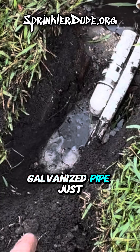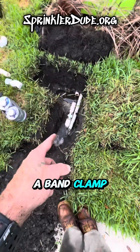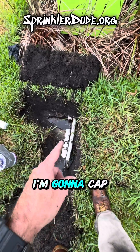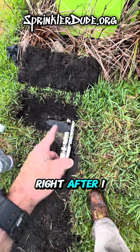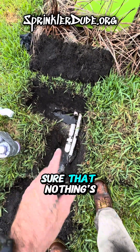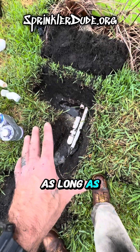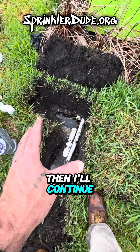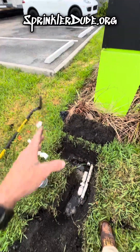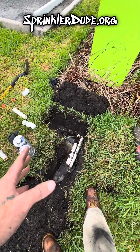It's actually a galvanized pipe just below that elbow there. Coming out of that elbow there's a band clamp of some sort and then the inch-and-a-quarter pipe. What I'm going to do is cap the inch-and-a-quarter pipe right after I elbow it in this direction and then turn on this meter. I want to make sure nothing's going to leak between my cap and the galvanized pipe. As long as everything checks out I'll continue the repair to connect it to the main line that's likely sitting right there. If it doesn't check out, I'll have to redo all of this. Wish me luck.